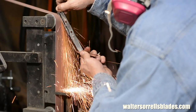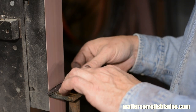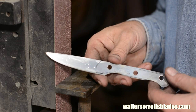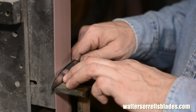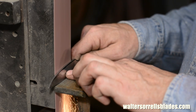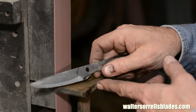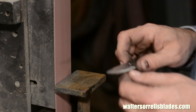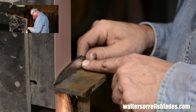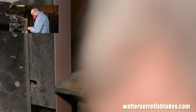Notice how I used the platen wheels to obtain some of the radiuses in the profile. I'll go ahead and grind the bevels into the blade. I won't say too much about the technique of grinding bevels because I've gone into that in a number of other videos. If you're interested in going deeper on that subject, I've got a whole video on bevel grinding. Once I've got the bevels almost where I want them, I'll jump up to a high-grit belt and refine the lines.